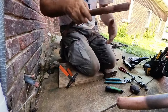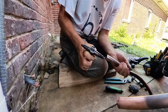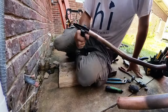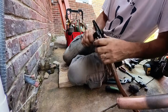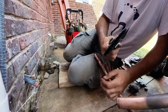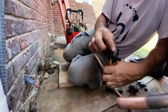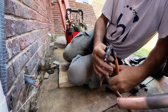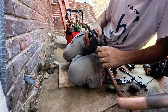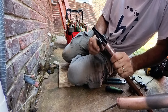So that finishes that really nice. On this expander, it's got different sizes. This one here is going to be right what the tube will be when I fully push it all the way down. Because this thing isn't round — you can tell there's a big split here — when you expand it, it isn't necessarily round. So what you have to do is keep working it around all the way. If you do that and take it slow, you won't have problems. I've read about guys who don't like them because it doesn't make it round, or it splits.